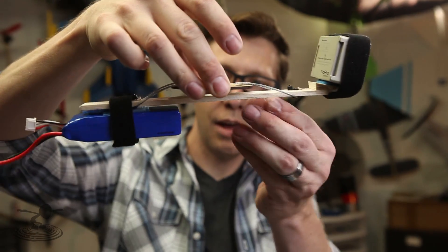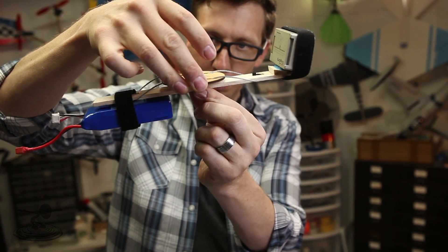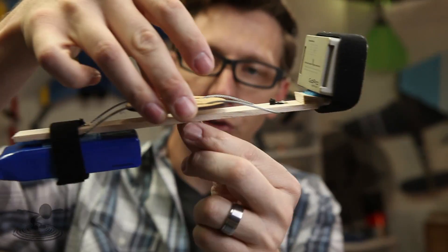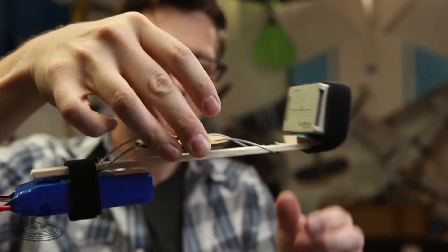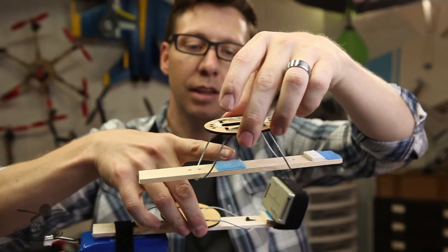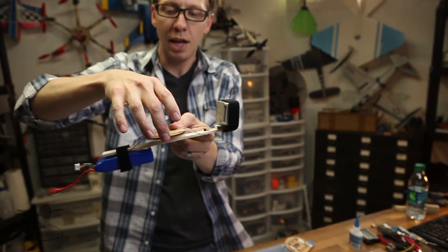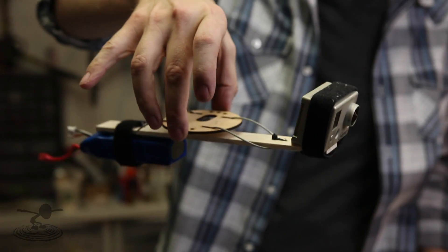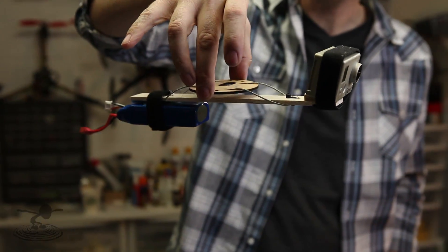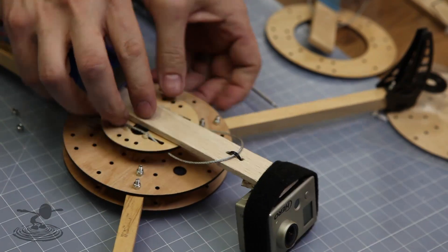As you can see, you now have a floating rig. If you want more tension you separate them - that's probably one of the tighter ones I've done. You can do less tension by simply moving in where your holes are. On these ones I had the battery sitting on top. The difference is this is easier to load - a lot easier to get the battery in there. You want to make sure you have balance: just hold your battery tray in the center and it's perfectly balanced. That's amazing because I just guessed! So that's the basic rig - we're gonna mount it on the tri-copter frame.